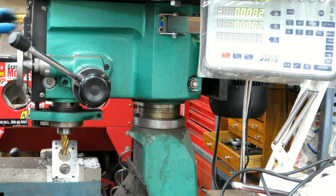It's a little weird trying to run both knobs at the same time. They were running in the same direction. Now they're going to be running backwards. I don't know if I can do it. And I'm stopping at 20 thousandths increments, just so I don't get one too far ahead of the other. And I've got it spinning fairly slow, apparently to keep the noise down, but as you can see, I'm moving so slow that there's no point in trying to cut any faster.